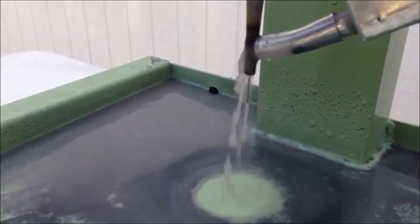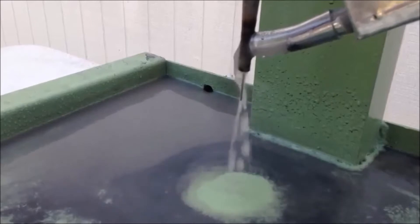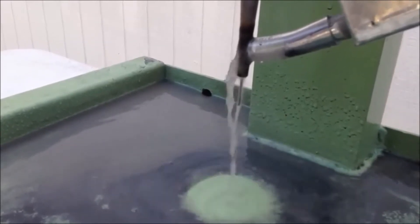As we go a little further in the video you'll be able to see it at times when we get the camera angle where you can see how the spray is coming off. And that's an indication you've got a nice harmonic tuning of this horn, which means the vibration is going to be transferred really well through that needle.